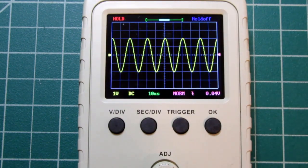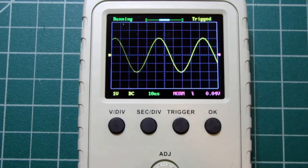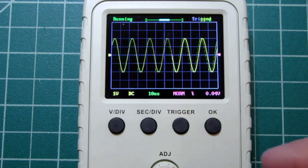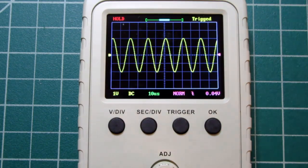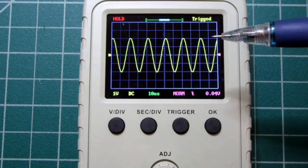At 20 kHz I'm getting something where I can clearly see it's a sine wave. But if I go back to 50 kHz — it's jittery so I'll put it on hold — I'm starting to lose the ability to tell what the waveform is. So even 50 kHz is pretty chancy. 100 kHz is useless. 200 kHz is a joke. I would strongly recommend that this scope not be used for much more than audio frequency ranges.